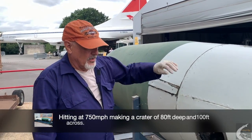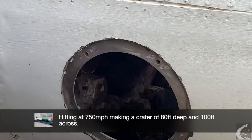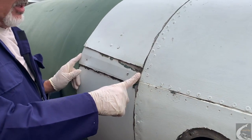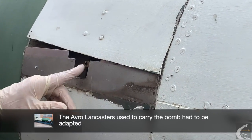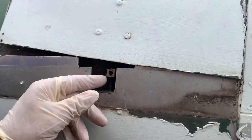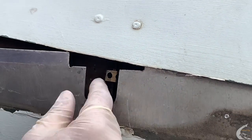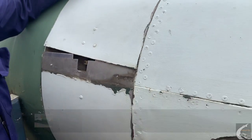We've now taken off the maintenance panels — you can see they're just held on by screws. Here is the closing panel where the turnbuckle is behind. We remove the rivets, pull it off, and you can see the turnbuckle here. It rotates with a left-hand thread on one side and right-hand thread on the other, and expanding it will release the fairing.